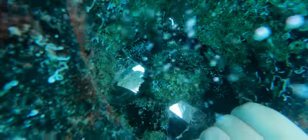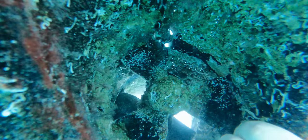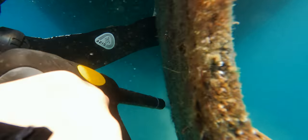Yeah, and I wanted to say something about cleaning the bow thruster. Normally with the copper coat it was kind of a nightmare to get between the propellers and to get everything out. But now with Finsulate it was very easy to clean it, especially with the cavitation technology, but also with the Scotch Brite. So I'm very positive. So the first two objections were that it doesn't stop growth and that it loses its function, that it lets loose. We talked about that now as well.